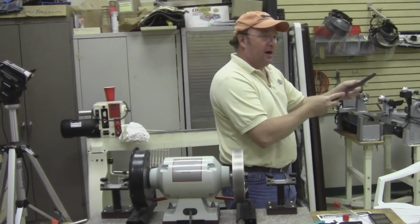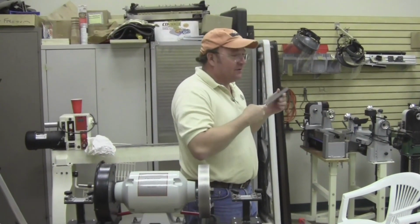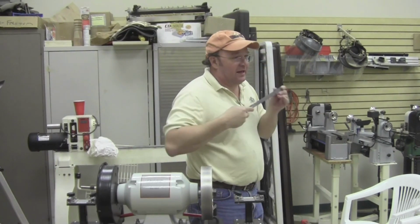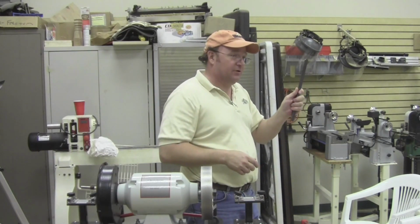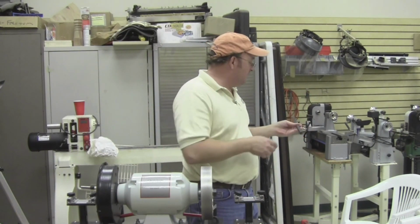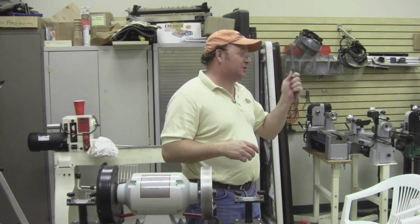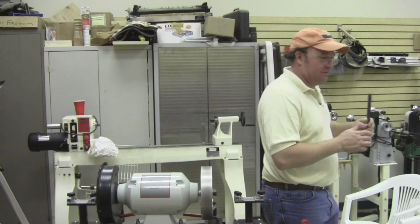That way you can turn the bottom. You just basically catch the edge, and it's cutting like a gouge, but yet as you go in, it's almost peeling like a scraper. It cuts and leaves a good surface. You're not cutting much material off with it, though. Like I said, a friend of mine, I was saying, I would love to try one of those, but I don't want to spend 85 bucks to try one. So he gave me one, and I'm not going to turn it down.